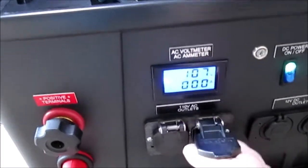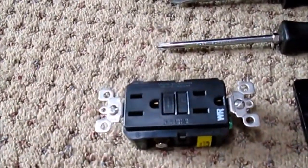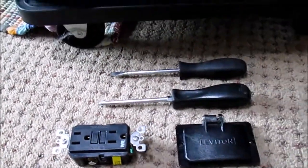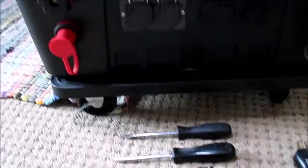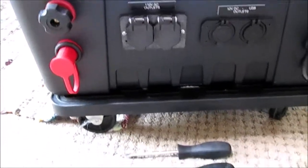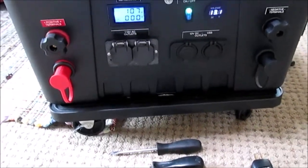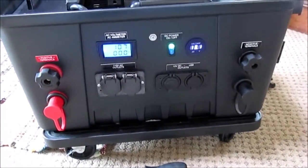What we're going to do today to continue to improve the safe use of this system is something I should have done initially — install a GFCI outlet, or ground fault circuit interrupter outlet. Using these can also improve safe use and protect your system. We're also going to install a new outlet cover that complements this GFCI outlet. The cover is quite expensive if you buy it from Leviton, and the GFCI itself is relatively expensive too, but it's hard to put a price on safety. We'll come back and test it with the outlet tester to ensure it's wired correctly.